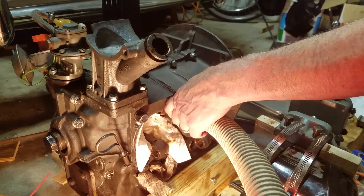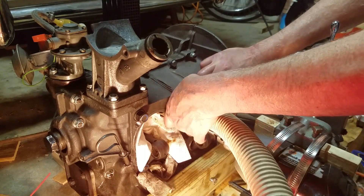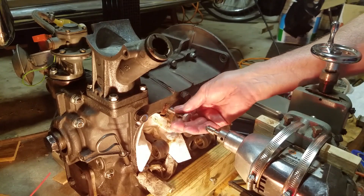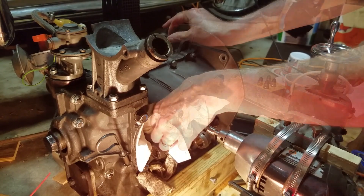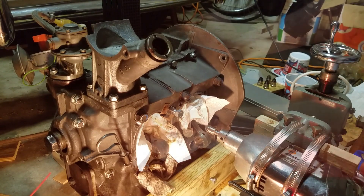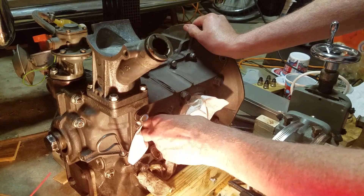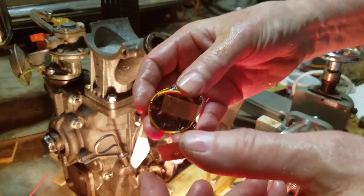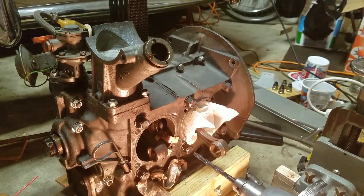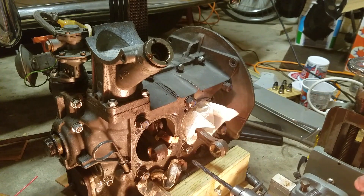For the open holes, I use a vacuum cleaner to clear as many chips as I can. For the closed holes, I use a little compressed air — always using safety glasses. Then I check the thread depth with a case saver to make sure the surface is slightly below the cylinder base. After the hole has been cleaned, I carefully remove the chip catcher and wipe out the chips. I adjust the X and Z axis to move to the next hole and repeat the process. After all four holes have been prepared, I move the crankcase to the next cylinder and do it all again.